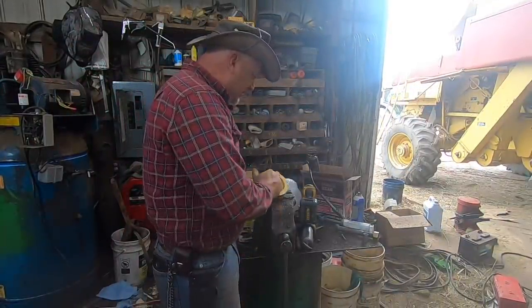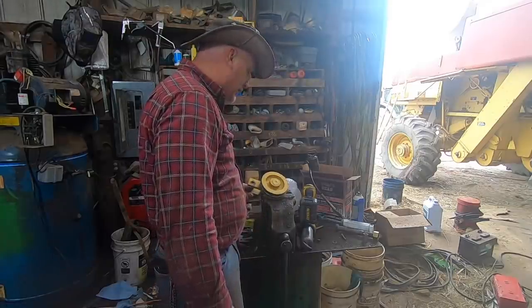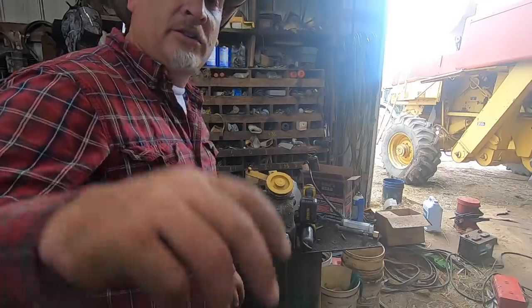This year sorted out. So it's got this little freeze-out plug, and I hate ruining freeze-out plugs. But I'm going to actually get a drill, drill a hole in it, and then put some air to it and blow it off of there.